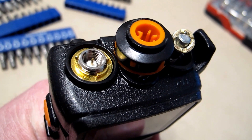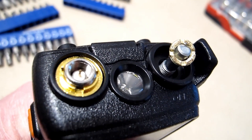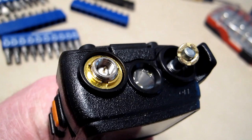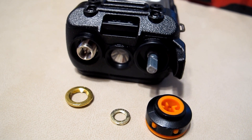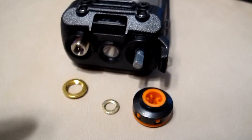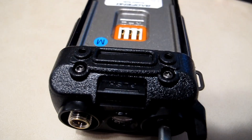On the left is the antenna, and on the right is the knob for volume. I've pulled it off — you can see the fastener there — and I'll do the one on the left with my needle nose pliers. I got both of those off, and I'm still looking for a tool for this guy. Apparently it's smaller than a T10 Torx.